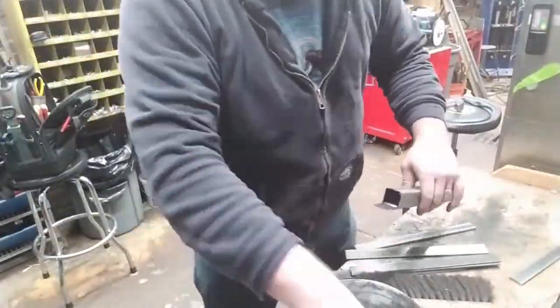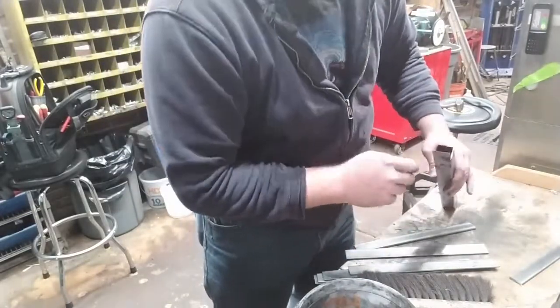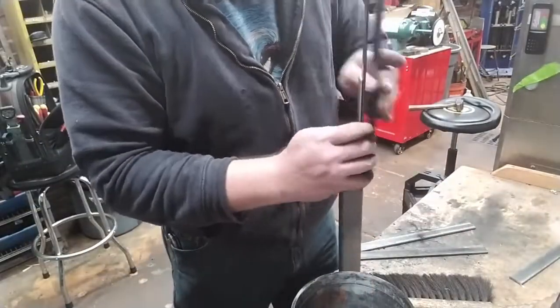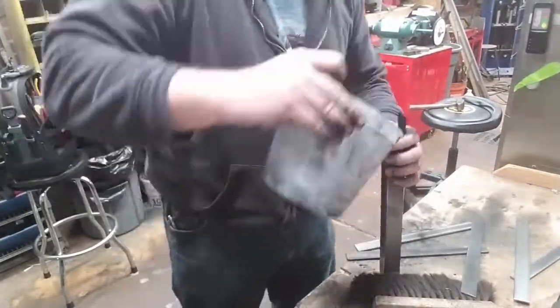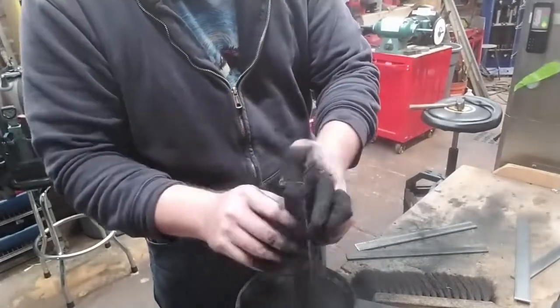Now, we're filling the canister with steel and charcoal. And the charcoal is, of course, a flammable material. If you've watched any YouTube blacksmiths making canister Damascus, you'll often see them drill a tiny little hole in one of the ends of the canister.